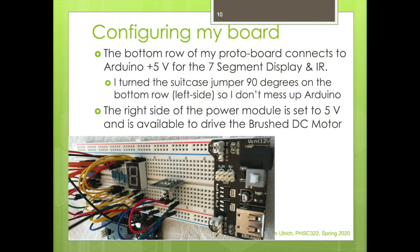Here's my protoboard setup. I've got my seven-segment display, the 74HC595 shift register, and an IR sensor. All three devices are taking power and ground from the bottom rail, which gets it from the Arduino — so I've set the bottom jumper to no-connect. The top rail, currently unused, is set to 5 volts so that in the next video when I add the motor and fan, we'll take power and ground for the motor from those power rails.